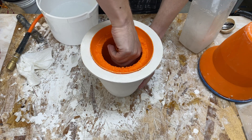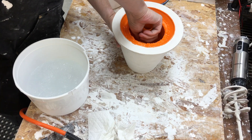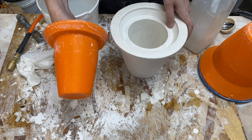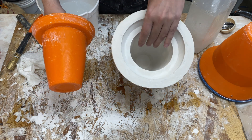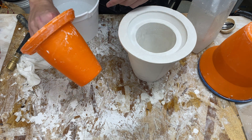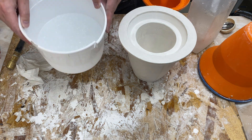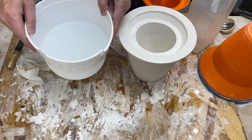All right now — oh this is cold. Oh perfect. Wow. That worked really well! So it went ahead and slid right out. It's still super cold — even the plastic is cold. The plaster is not though, it's cooled down a little bit. And indeed there's still some plaster that's stuck to the outside edge here. So I think it is the texture of the print that's grabbing onto the plaster. Chemistry for the win! I think I can go ahead and save this and put it back in the freezer and reuse it. Definitely a trick to keep around.